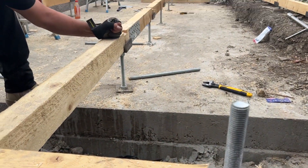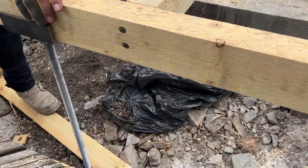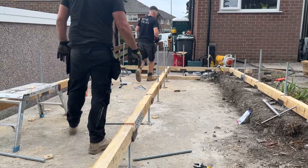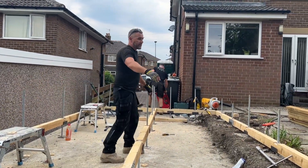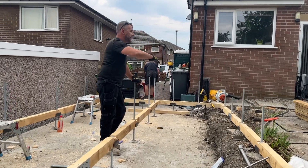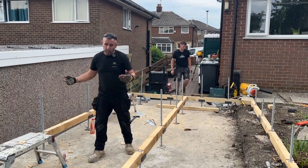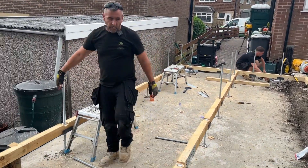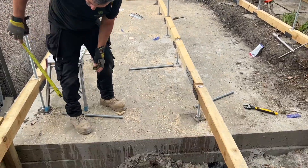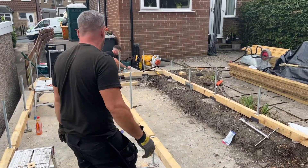You can see the thickness of the pad there — we've drilled it, chem fixed the rods in, and we've also fixed the longer rods in as well. It's worked in every single situation. The other option here would have been to dig out the soil, but then the garden room would be lower than the land and you'd have to dig further back to access it, or you could have built the pad up with another 10 inches of concrete and more shuttering. The rod system worked perfectly.